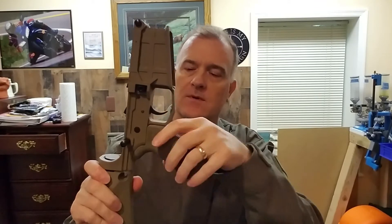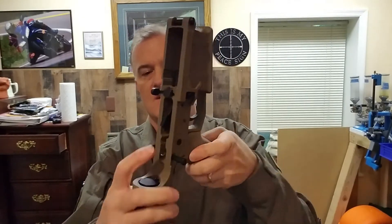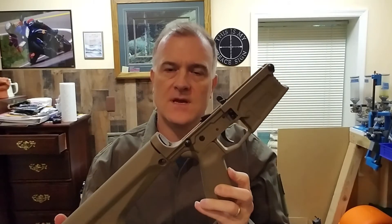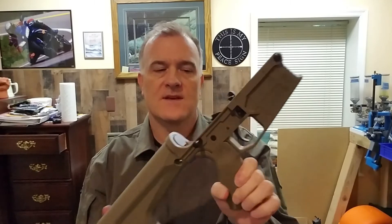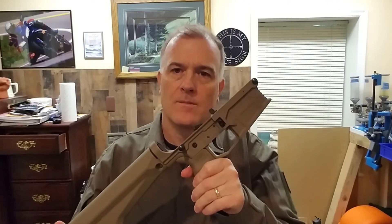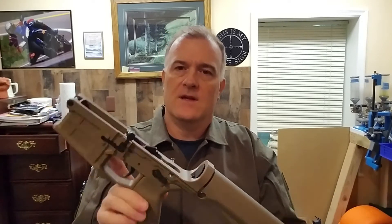The detent helps make positive clicks for the selector lever. That's what this wider area is. James Madison Tactical recommends drilling from one side all the way to the other, so if the drill bit were to wander and something was out of square, it may make some parts not perfectly straight. But what I do know is that this will fire — it will shoot. The hammer's lined up enough to hit the firing pin at the back of the firing pit, so that part is working.